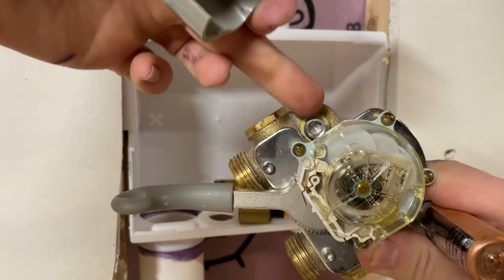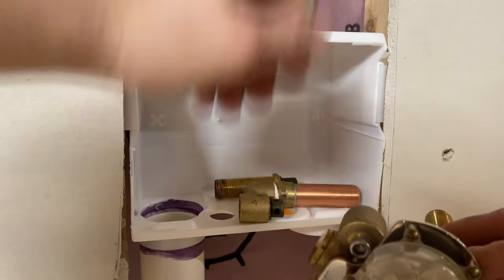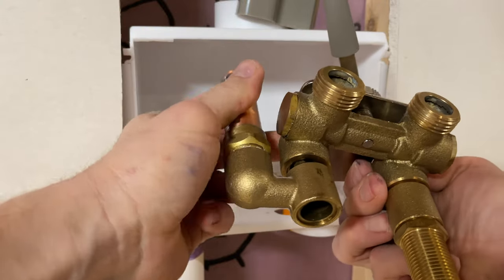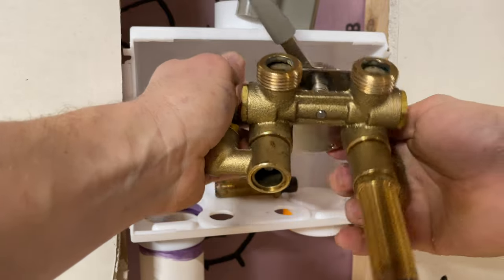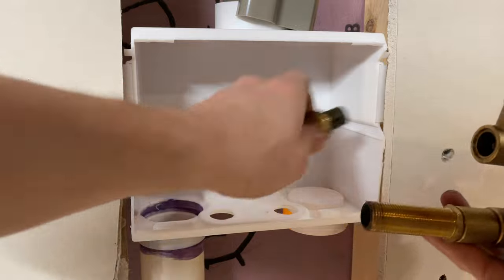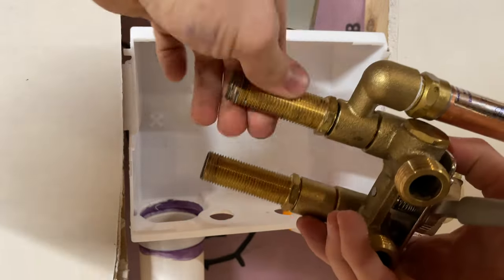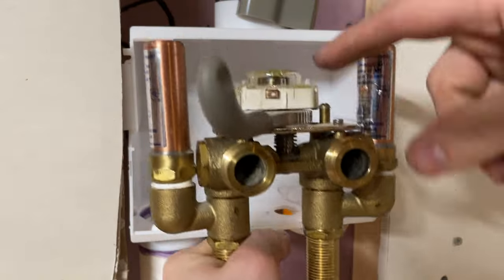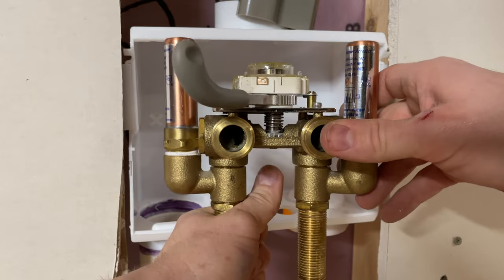And then that screw right there, Allen screw, goes through your water hammer like that, and then inside of there it connects to that threaded piece. Okay, so that's it, that's all that's holding it in there. And I recommend threading this connection so that way if and when this thing ever breaks or fails, you can disconnect it, not have to open up your wall.